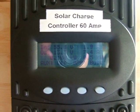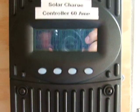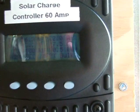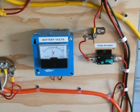Otherwise I would spend the money on higher capacity panels that you can get for the same price — you'd have fewer connections and less wire footage — but they're working pretty good as you can see. Right now it's dropped down to seven and a half amps, and you can see there are clouds all over the sky, so we're getting a cloudy day out there and that's what's happening.